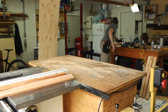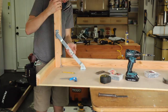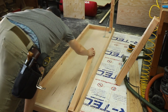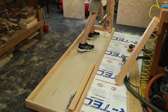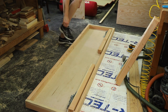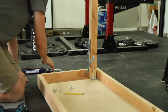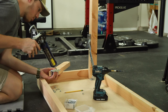Because the lumber and cutting isn't actually that difficult, this is where it starts to get more complicated with the hardware. I had to get a lot of hardware that I then returned and went back and forth on several designs in order to get the legs to be sturdy. The first iteration involved only one metal bracket, and what I quickly realized was that the hinge in combination with the one bracket was not going to be strong enough. The racking was only being braced in one direction and I needed one in the opposing direction.